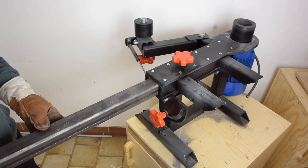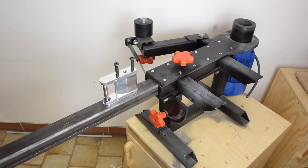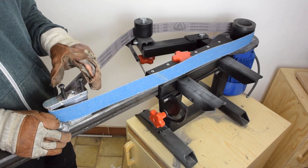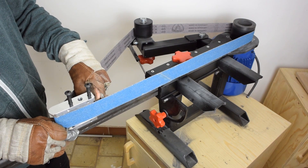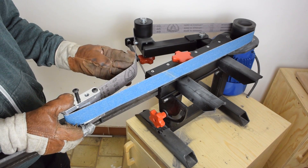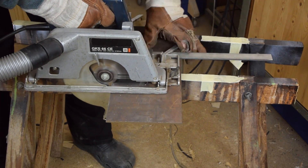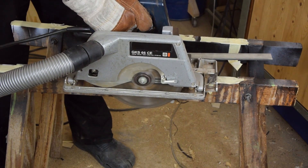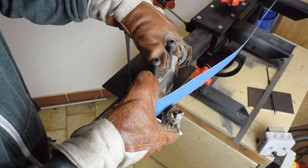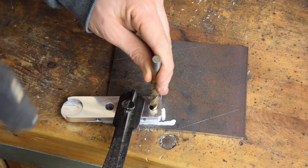So this is a fresh piece of square tubing and I'm just gonna try to lay this out. The belt hits the knob, so I think I'll have to offset this somewhat to the side. And then I need some kind of a pulley on the outer side of the belt. A cheapo brad-point bit makes for a perfect transfer punch.